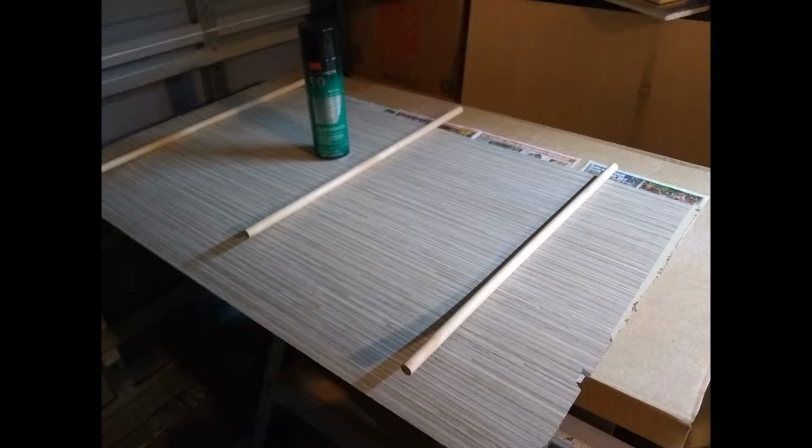I used some round dowels to support it when I initially placed the Formica down on the plywood. That way I can get it positioned accurately, and then you pull the dowels one by one from the middle towards the outside and press it down, locking it in place. The dowels help because you only get one chance at getting this lined up correctly, and my piece of Formica was pretty close fit lengthwise, so I needed to be as accurate as possible.